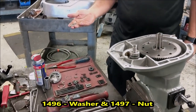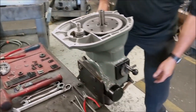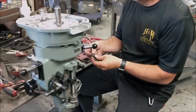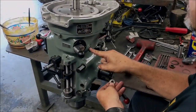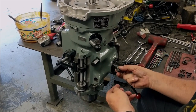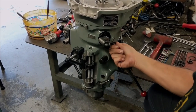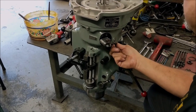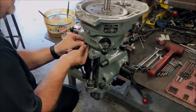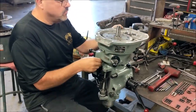You have three washers and three nuts. You start over here. You'll notice on the quill housing that there's no spindle oil anymore. We took that out because when we rebuild a spindle, we turn it into a closed system, so there's no reason to oil the spindle bearings anymore. Take your nut and your washer, just put it on — not tight, just where they touch, maybe a little finger tight. It's on. You can move it, but it's pretty stiff, which is what I want it to be.